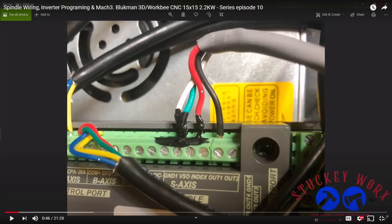We identify here that there is no ground drain coming out of this end. We know he's identified it as shielded cable, so we're going to make an assumption that the other end is properly terminated for the ground drain, and this way he can mitigate at least some frequencies of EMI.